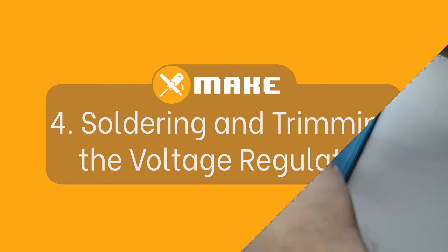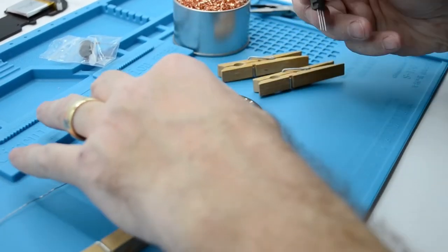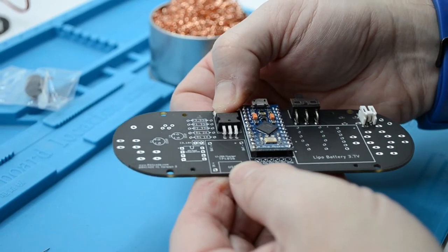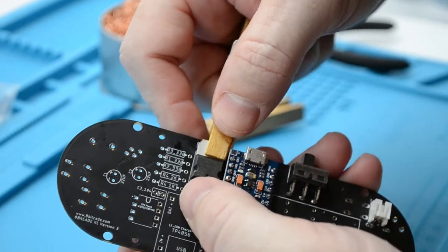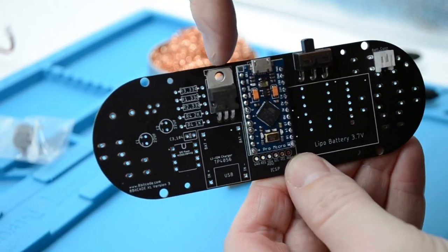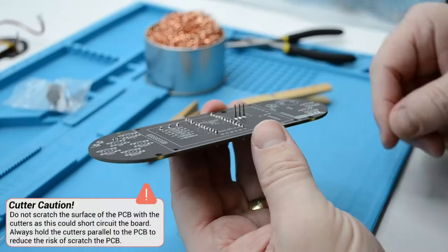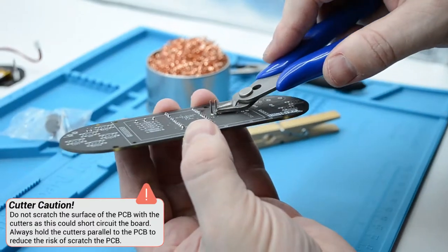Fitting and soldering the voltage regulator. Grab your voltage regulator out of the bag and place it vertically in its pins as outlined on the PCB. Then, using your thumb, bend the pins, pushing the regulator till it touches the PCB. Once it is touching the PCB, push the component into the pin holes to create a 90 degree bend in the pins, until the hole in the regulator and the PCB roughly line up. If the regulator does not lay flat while you solder, you can clamp it down with a peg. Flip the board over to the front and solder the pins in place, remembering to tin the bit before you start. Once complete, grab your cutters and cut the pins, making sure to cut above the solder joints and point the cut down for safety.